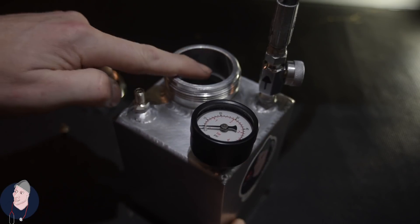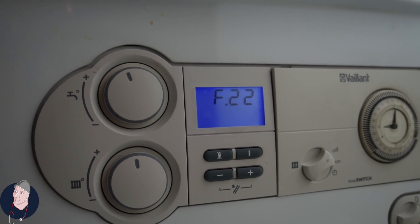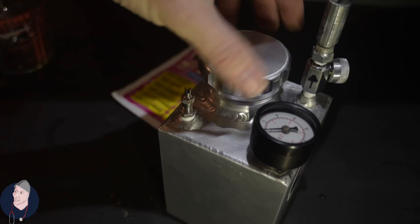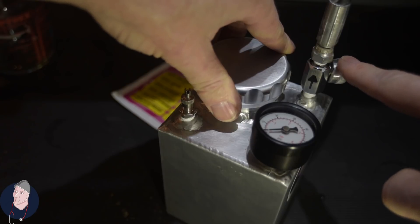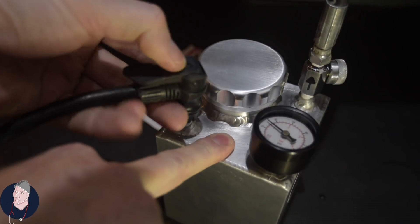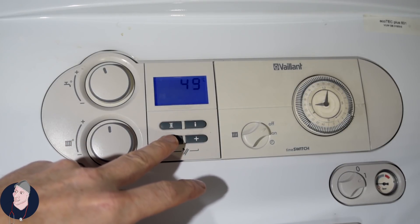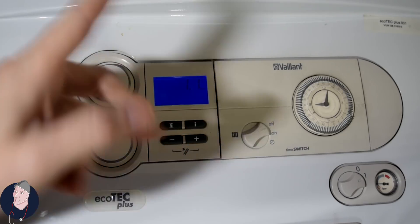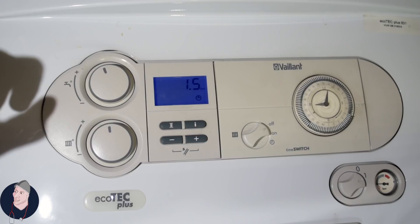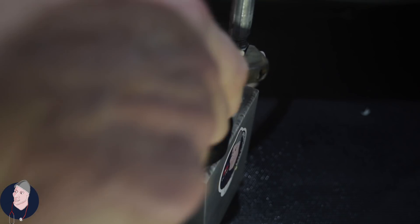You can discharge this water and introduce more inhibitor, and check for water quality. With the system pressure at zero or thereabouts, you can then test the vessel. This is about a litre — I've pre-mixed it and this is biocide. Put the lid back on. Personally I use a foot pump — open that up, open up the valve, we're at one bar, done. Check the boiler — you can now turn it back on with no gas on. Pressure should be displayed: 1.1, thereabouts. Cycle. The biocide is now circulating around the boiler. Check the pressure: 1.5, back to 1.1 — pretty much what it was before. Simply open the valve and discharge any pressure from this line.